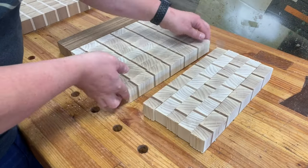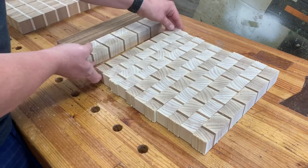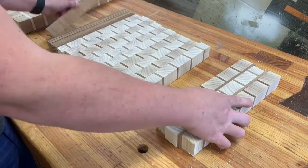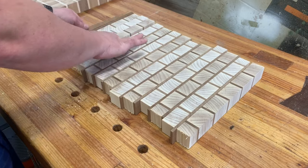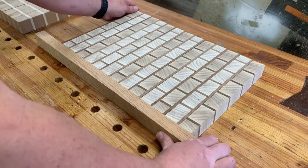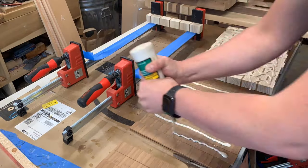Here's the flip: now they're all cut to size. If you flip them, notice how that thinner piece really pulls off the pattern — it saves material too. In between each of these thin pieces it's all end grain facing up. Don't change the direction — wood movement will cause the board to fail, split and crack if you mix direction. You really need that end grain in between.